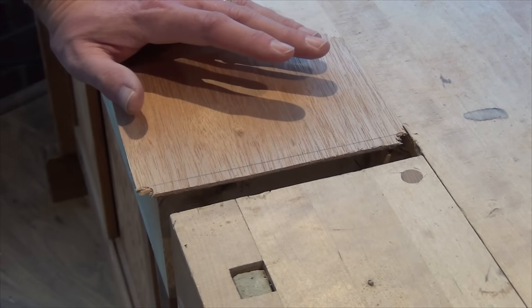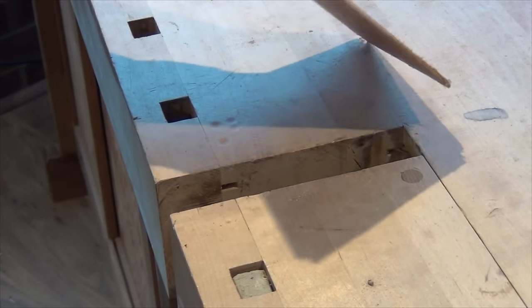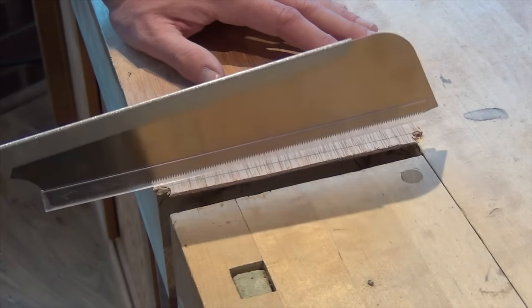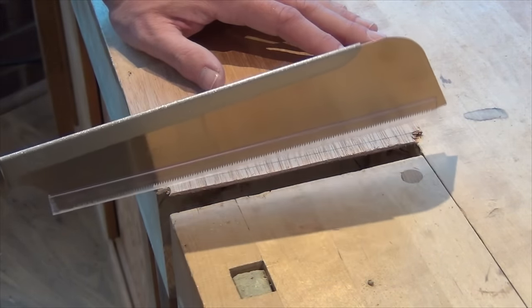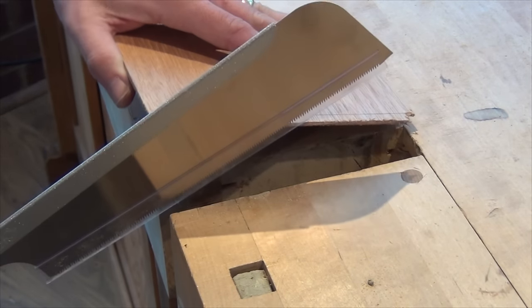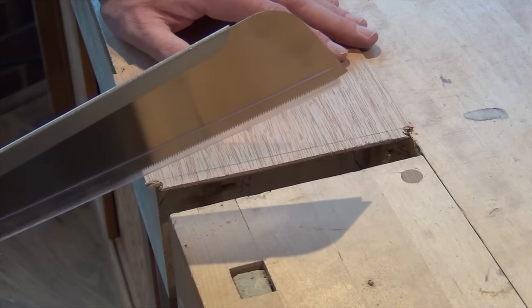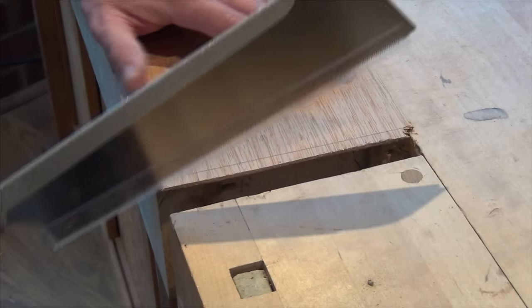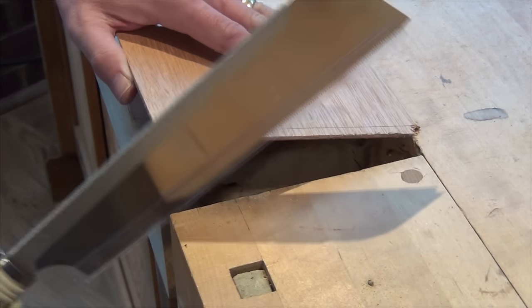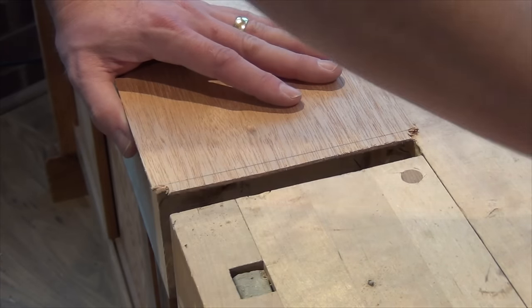If we're going to do large cuts — for example cross cuts, or as I am here cutting a piece of man-made material — it's a long cut. The only way to do that with a back saw like the dozuki would be to have the saw almost level, because otherwise the back is going to get in the way. An efficient cut has up to about a dozen teeth active in the cut at any time, so you'd really want to lean it back at about this sort of angle — and then the back is going to stop you getting through your cut. So that's somewhere where I'd use the Kataba instead.